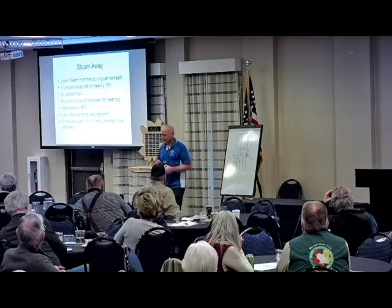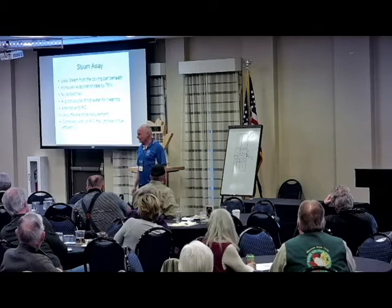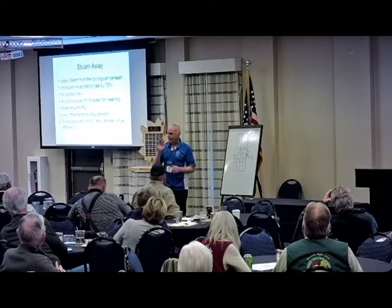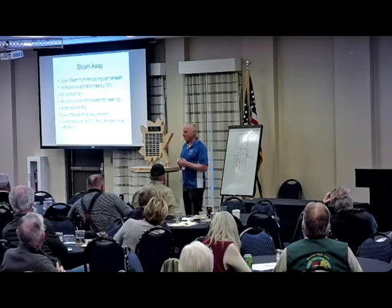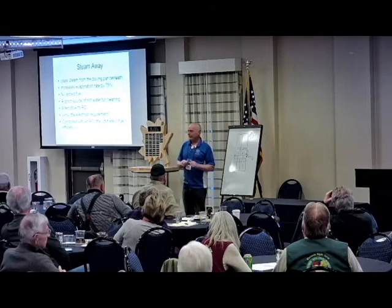Now, if we want to go to what we do at Eden, let's turn this number to 30. Now, I won't put all the numbers in, but you can see it happens really fast. And so we need a special evaporator to boil really high Brix concentrates. That's what I'm getting at. What we designed into our Eden facility at first was big, giant, flat pan evaporators, and they worked really nice. Andy Sipple's got one. I don't know if you've been to his place and seen it, but he boils 30 Brix concentrate as well. And so what's our evaporator look like?